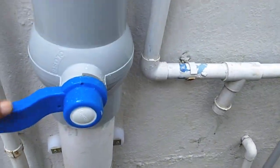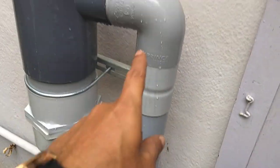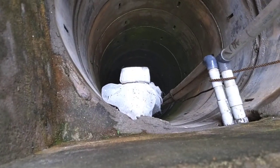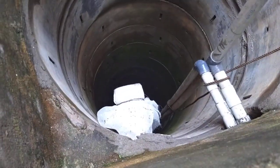This is the initial water that contains the maximum quantum of dirt. This is the second filter. Again, the filtered water is channelized and gets into this underground pipe, which goes straight into my well. As a second stage filtration, I have fixed a cloth mesh used for wrapping around borewell pipes, so a second stage filtration takes place here and the filtered water gets into the well, charging the ground.